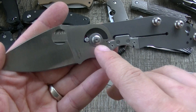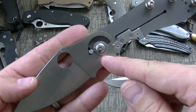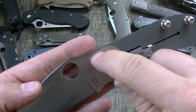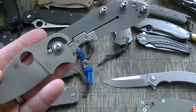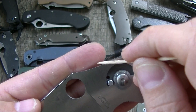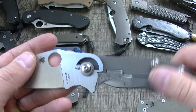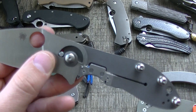Using an internal stop pin does remove some steel around the pivot area. I wish someone good at physics could weigh in on the actual forces involved. Look at how much you have to mill out of this blade — it's very thin here and here. You've taken away a lot of the blade's meat around half the pivot. For a hard-use knife you could potentially get a hairline crack in that area.